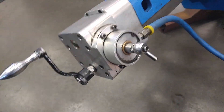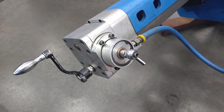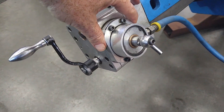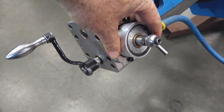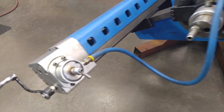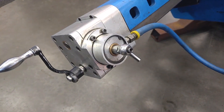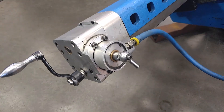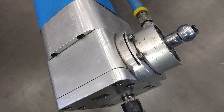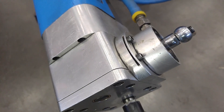Moving this even just a little bit can put the piston in a bind. The quick fix is to just loosen these four screws — you don't have to take them out, but they need to be loose enough that you can move the piston body freely on the gearbox. Ideally, put a little bit of air to it and make the piston actuate in and out. It'll self-center and right itself to its freest position. Once you've done that, lock the screws down — just be careful not to tighten them down too much. That slot on the side is the exhaust for the piston.